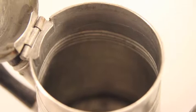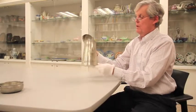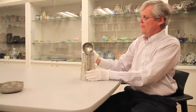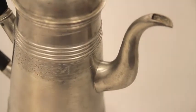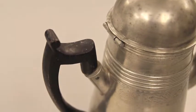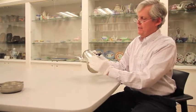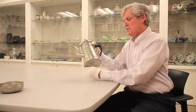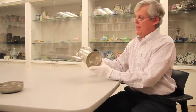The extra metal at the top is where the pot was vulnerable to being hit, and of course there is more metal around the base where it is again vulnerable when laid down on the table. The spout is cast in two parts and soldered on. The sockets for the wooden handle are cast and soldered in place. The bottom is another piece of molded pewter that has been soldered to the underside of the sides.